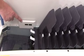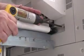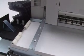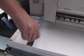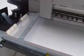I'd also like to point out the paper detection for the front bin full sensor — basically we have a sensor here that reflects off the triangle to see if there's paper in the bin. I'm going to secure the sorter to the rear frame and also to the rear bracket I installed earlier with two screws. These are long screws as well. The last of the pan head screws goes up and underneath the sorter onto the rear panel. We're now ready to make the connection between the sorter and the SureLab unit. The clear plastic guide now gets installed on top of the conveyor unit — I need to remove the three white thumb screws, position the guide in place under the rollers with cutouts for the knobs, and re-secure with the thumb screws.